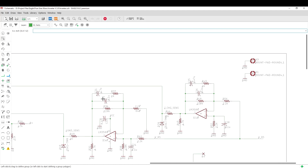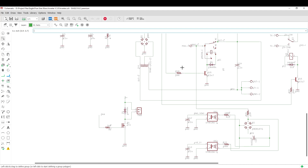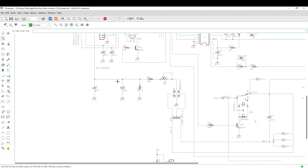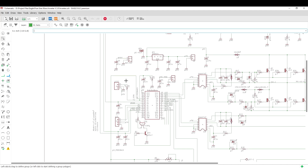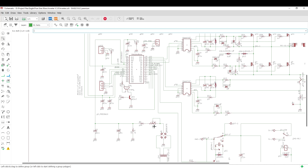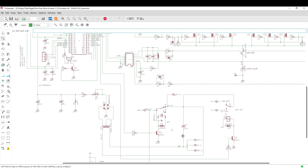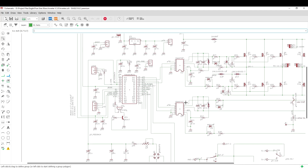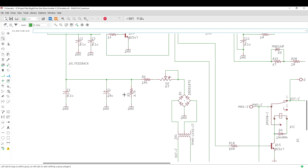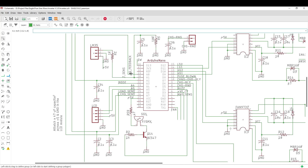The capacitors in the feedback loop help to reduce the high-frequency noise generated due to PWM switching. In the output voltage feedback, I have used a slightly larger capacitor, placed after the voltage divider resistors. This creates a latency in changing the voltage level in the feedback. Since the microcontroller uses a lookup table to generate the SPWM, whenever it encounters any change in the output voltage feedback it recalculates the whole table, which takes almost a millisecond. So if the feedback voltage changes again by that time, the microcontroller starts recalculating the lookup table again — and what we end up with is an unstable output voltage.